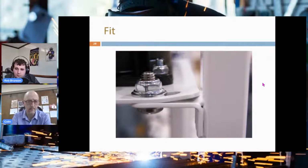And I said, wait, hold on. Why don't we just notch the part? We just notch out the little motor mount bracket there. So you give clearance to the weld. And they're like, oh yeah, okay, that's a good idea. So sometimes you don't want to overthink the solution, right? Sometimes you just got to find what's the practical, observable one, and that is zero cost impact, zero impact on the strength of the bracket. Right. And it was a very simple solution to put in place.